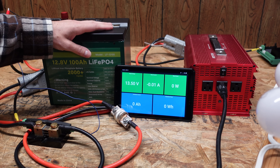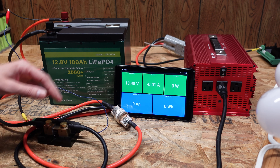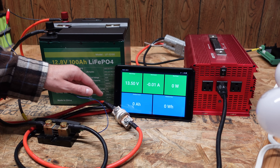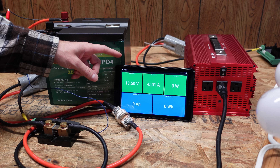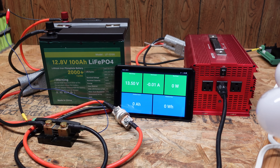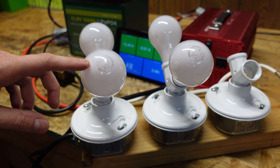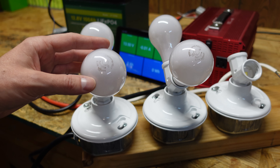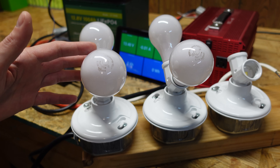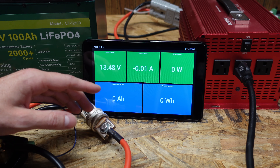I've got my standard test setup here. The battery is connected to a Batrium shunt as the metering device, going to a 2000-watt 12-volt inverter. I have an HRC fuse for protection and safety. My Batrium off camera is transmitting data to an Android display where we can see voltage, amperage, wattage, discharged amp hours, and discharged watt hours. My load is a series of incandescent light bulbs — 72-watt bulbs. I charged this battery off camera ahead of time using an iCharger X6, charging until the BMS cut it off. The target is a 20-amp load or a 0.2 C rate.